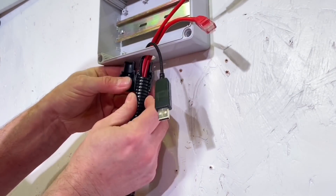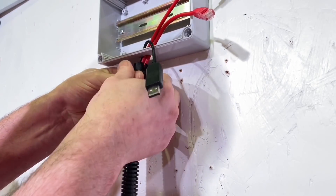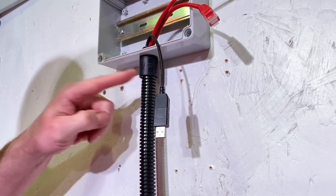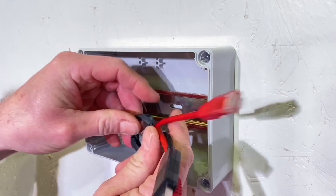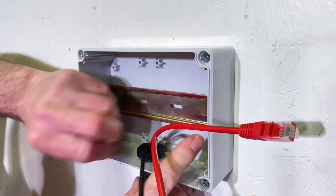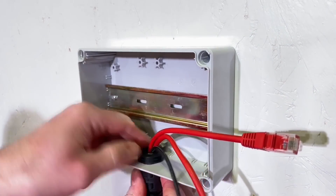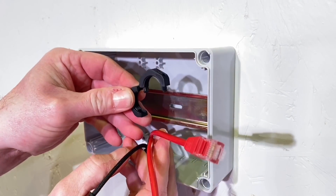We've got the split gland itself. Just fully insert it up to the end point and click it together - a nice firm press. Push it back into the box and you're ready to put the lock ring on. This has been well thought out: bring your lock ring, open it up, clip it round the cables - don't try and put it round the conduit itself. Clip it together, tighten it into position. You can see we've got our cables protected by the flexible conduit. And if you wanted to remove it, just reverse the process - take off the lock nut, open it out, and pull it apart.